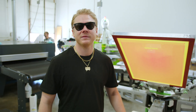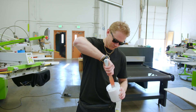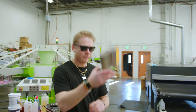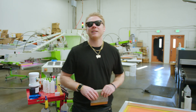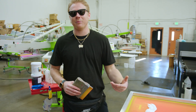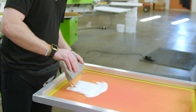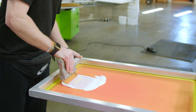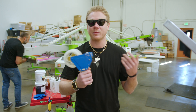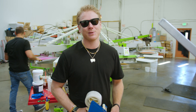We're going to load the screen up now, print the pallet, and get it ready to rock. So we have our ink in our screen. Now what we're going to do is lay down that first print on our pallet — we need an idea of where we want the books to lay down. We're using a water-based ink, so once we make this first print we keep that screen flooded. All you really need to do once you print the pallet, especially when you're going to be laying the product on top of it, is just take some clear tape, cover up the print itself, and that way you have an accurate placement of where it is without smudging that ink.